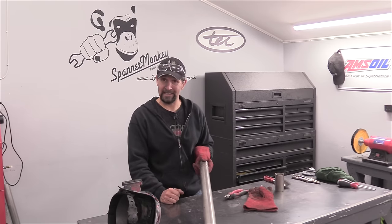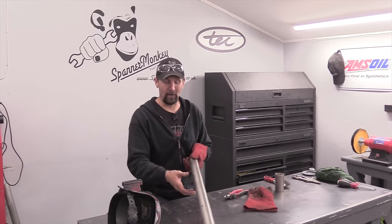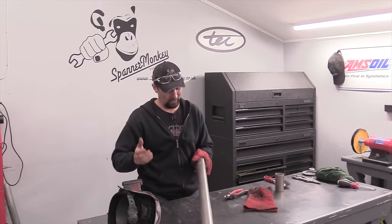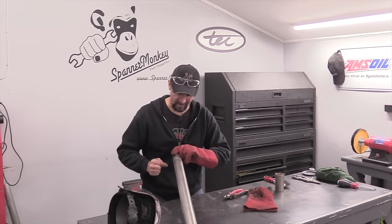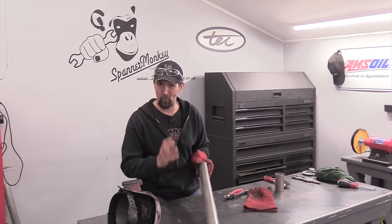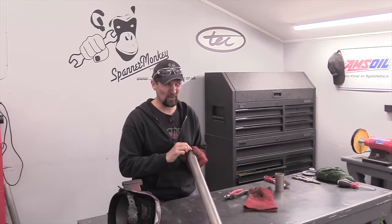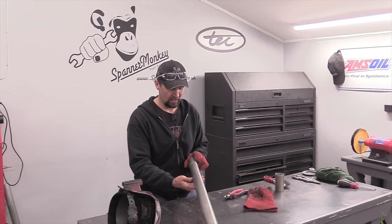And also, if I'm gonna do these three downpipes under the bike, then the collector will be under the bike. And in that sense, not quite so exhibition as a high level. But look, no excuses. I enjoyed that. And I'm very impressed that it was actually that easy first time out, because welding thin tubing is always a challenge. And this stuff is about 1.5 mil thick. So it's not that thin, but it went very well. Great, happy first effort. Let's get some more done.